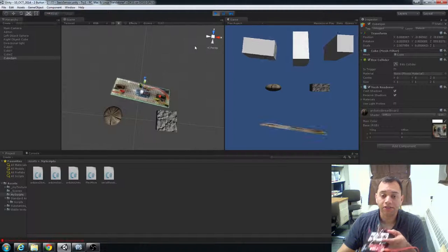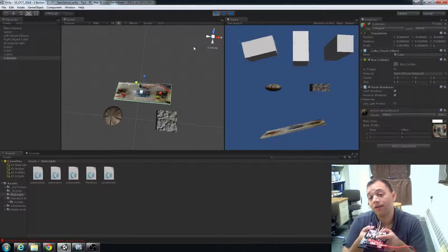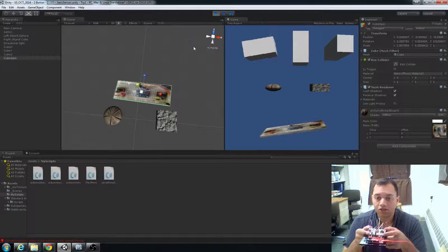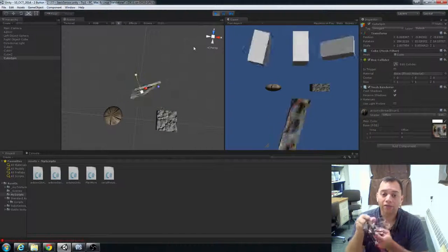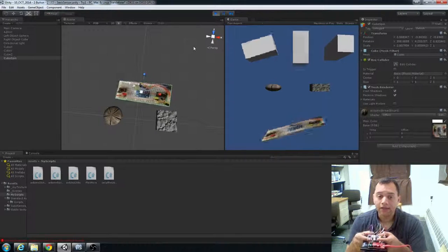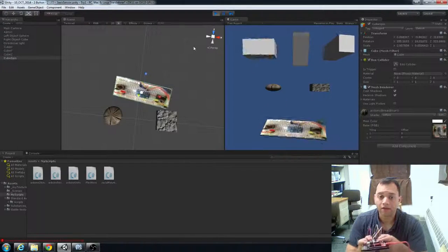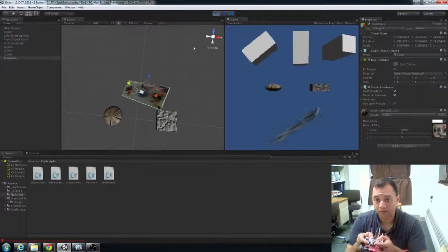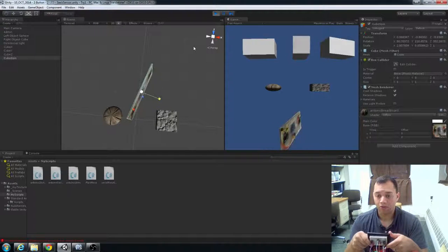Anyway, this isn't going to do what I want to do. What I need to actually do is get a gyroscope, and then I probably need an accelerometer as a point of reference. If you look at the shape that is looking at the X coordinate, you'll notice that when I rotate my actual Arduino board with the ADXL335 on it, it can measure that it's turning left or right in negative values, because it's looking at that axis with respect to the pull of gravity on that axis. Same thing if I flip the board front or back.